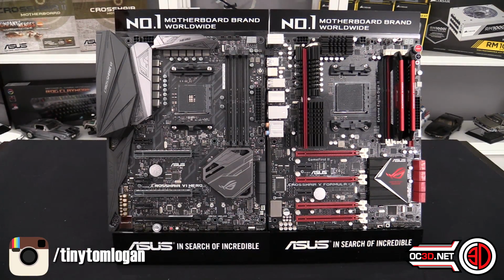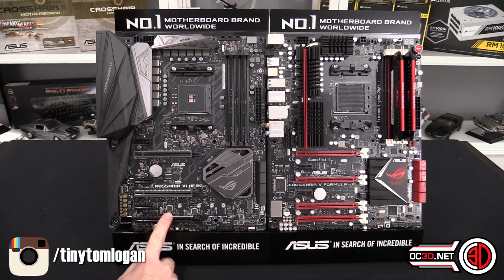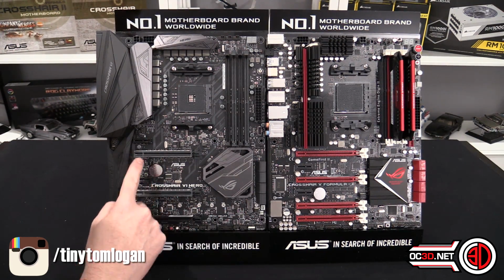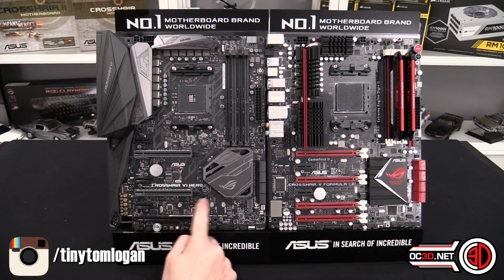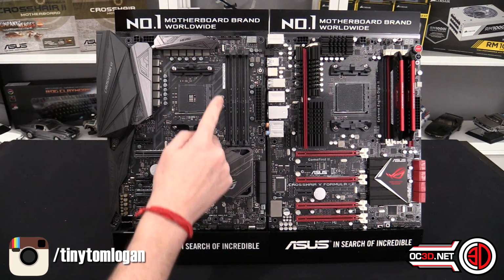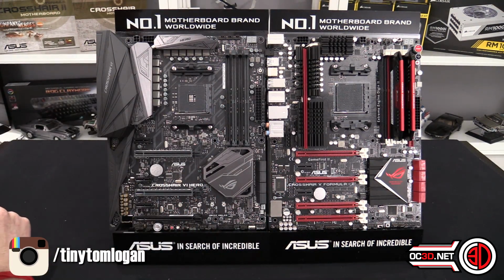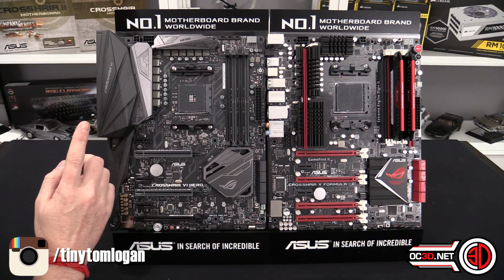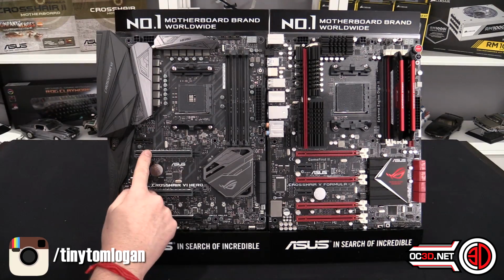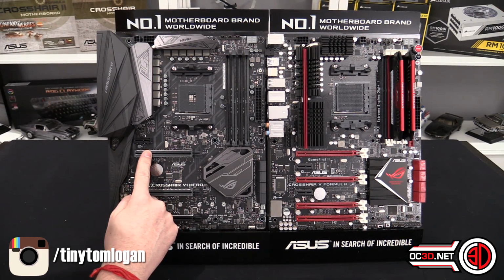A lot of people have also been asking about this slot here. Now, this one is wired as an 8x, but it's technically a 16x slot, but this is PCI Express 2 bandwidth. So are the rest of these ones here. This, and this come from the chipset itself. CPU wise, 16 PCI Express 3 lanes. It's the first time we've had it on an AMD board, because on this it's PCI Express 2. This we've now got PCI Express 3.